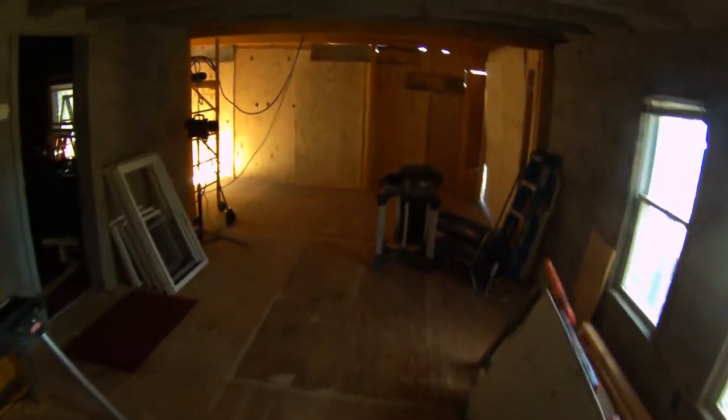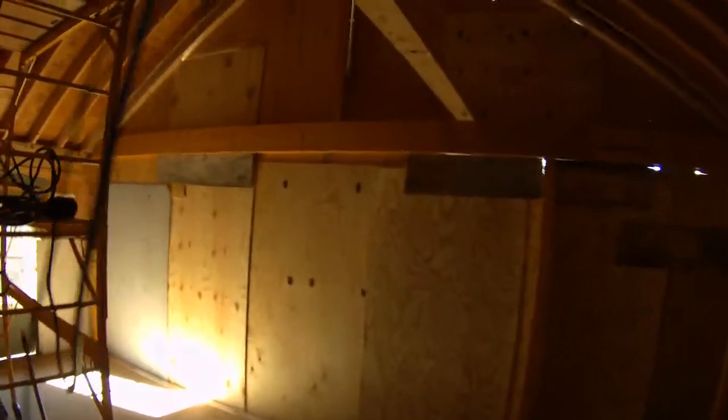So far we have the laminate beam in and I've cut out all the old braces. This side is sheeted with three-quarter-inch sheeting — eight feet wide and six feet eight inches in height. I've put some sheeting up here just to keep the inside warm.